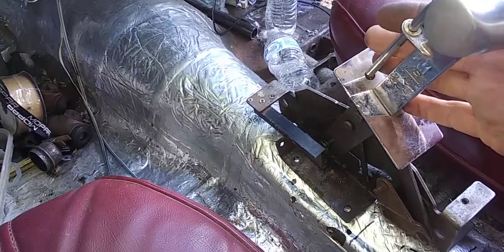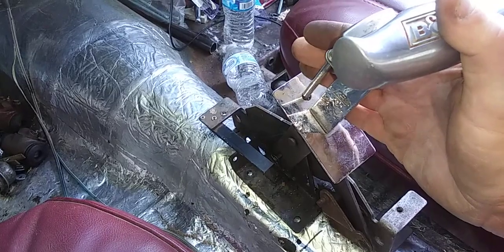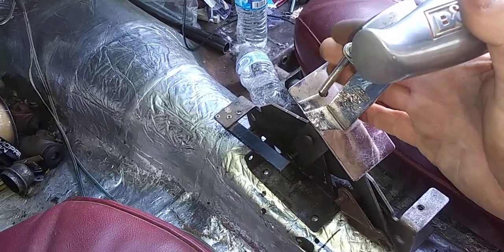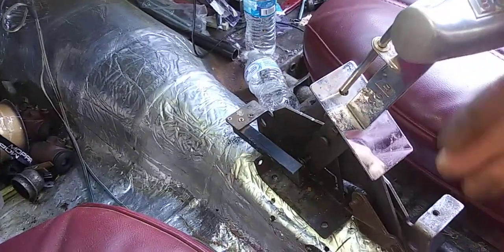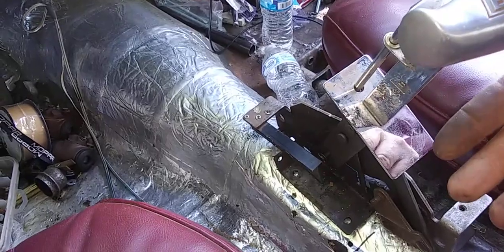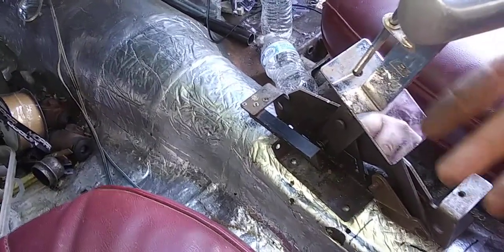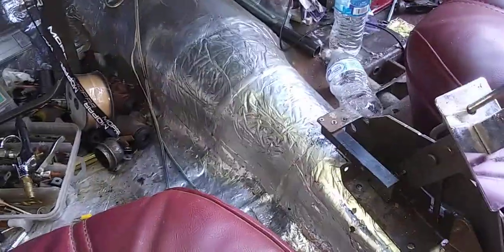It is just the regular pattern Chrysler shifter. And then what you do is when you come all the way back to first gear, you pull up on the lever, it goes back about another 3 inches all the way back, and then it turns into a ratchet shifter, so you can go from 1-2 drive real quick. This is going to go in here.